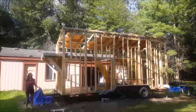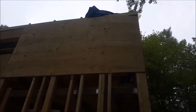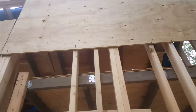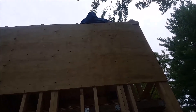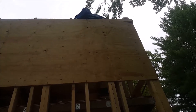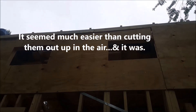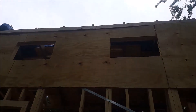Today we're putting the sheathing on the walls. That was easy. The way we're putting on the sheathing: we measure down four feet and put nails in so we can set the sheathing on it. Then somebody holds it from this side and I go on the other side and draw out where the window is. Then we take it down, cut it, put it back up with some glue and put some screws in to hold it in place. Then I'm going to go back and nail it.